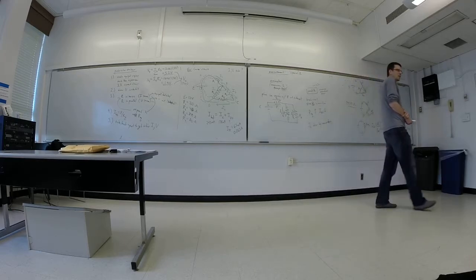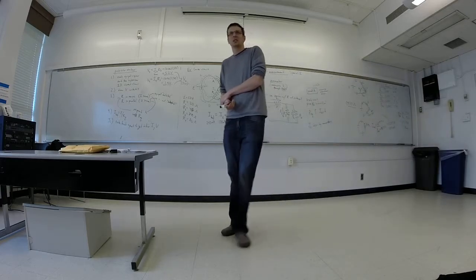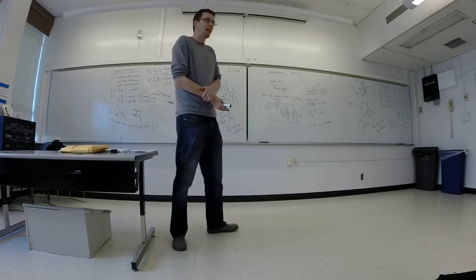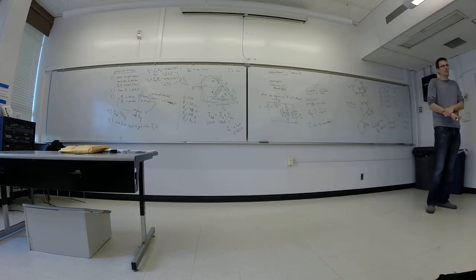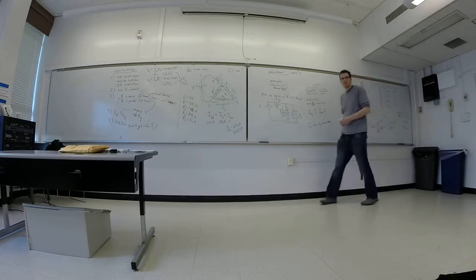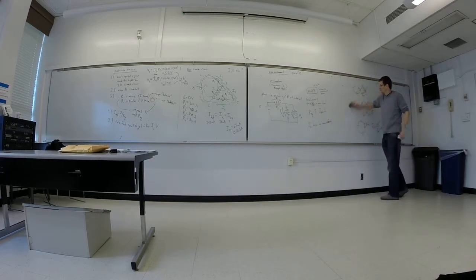So again, in summary, an ammeter is a special resistor that measures the current through itself. It has a way of telling you what the current is through itself. You put it in series with a resistor of interest, because then the readout of your device will be basically the current through that thing. And what you do is you hope to make the ammeter a very small resistance so that it doesn't greatly affect the current that was going on there before you put the ammeter in. Okay? Does that make sense? So it is technically true that the current is diminished when you measure it, but the hope is that that's on some decimal place that you don't even care about. Okay? And minimizing the influence of measurement on the circuit.